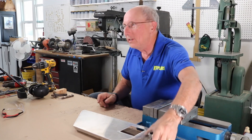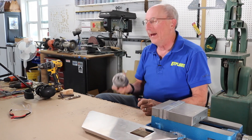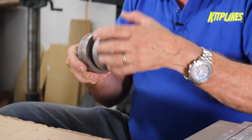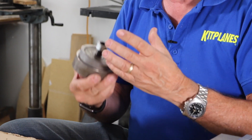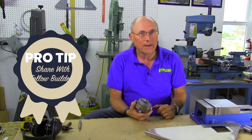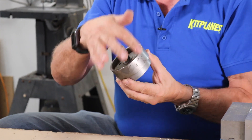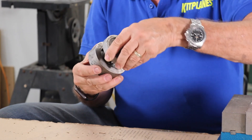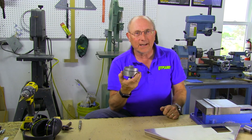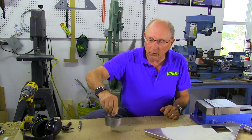Probably one of the most convenient ways to cut instrument holes is to use a Greenlee punch, which is designed exactly for that. A Greenlee punch is a type of punch which has a blade that cuts into a recessed circle. There are specific sizes, and owning enough of them to cut all the different sizes you might want is expensive. But this one is designed with two sizes only — one for large instruments at 3 1/8 inches, and one for small instrument holes. Today we're going to show you exactly how you use one of these, and it all starts by drilling a hole for the central bolt.